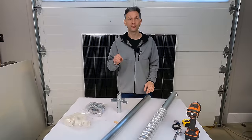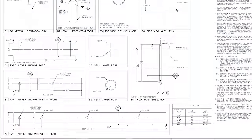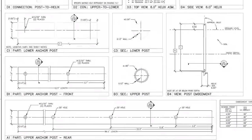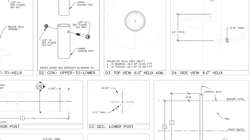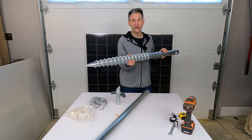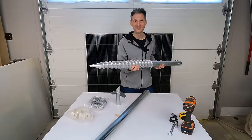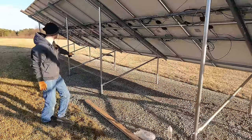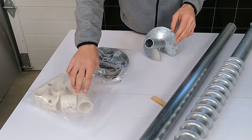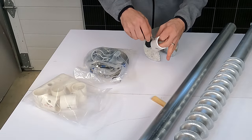This screw system is what makes the ReadyRack system so DIY friendly. ReadyRack can engineer a solution for your specific soil conditions. The length of the screw and the diameter of the helical can be adjusted for frost depth and soil conditions. There's even this massive ground screw for rocky soil types, and this thing is a beast. The bolts and stabilizing cables for each segment come all bagged together, and all the spacers come in a little bag.